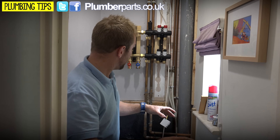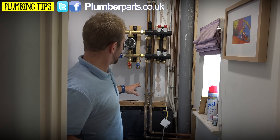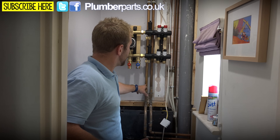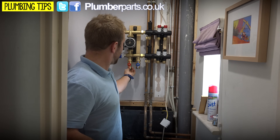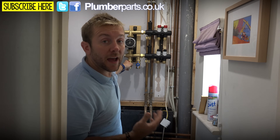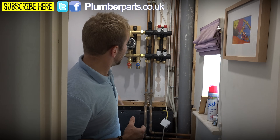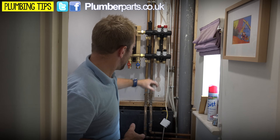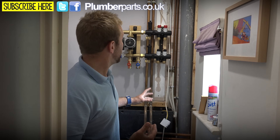It's kind of a temporary install at the moment while other work's going on in the house, as there's going to be a side extension going on. For the purposes of this video this is going to be fine. What we're going to do is ascertain which one's our flow and return, pipe into these two here, and then everything should be okay to run. But before we do that, I'm going to mark out where the kitchen units are going to be in the kitchen, then staple out our pipes and bring them back up here into our manifold.